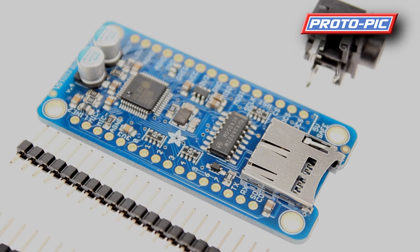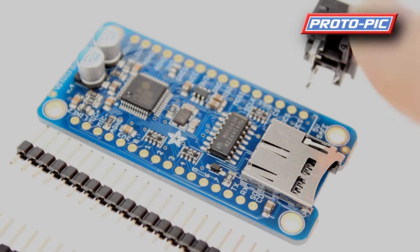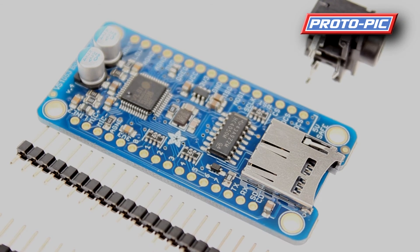This board is capable of decoding MP3s, WAV files, MIDI files, and OGG files. It's controlled through an SPI interface and also has capability of running as a MIDI device. The instructions will be linked in the description below. It's capable of running at 3 volts or 5 volts without any buffering, as the buffering circuitry has been built in by Adafruit. It's supplied with headers and a headphone connector, and you get two sets of headers.